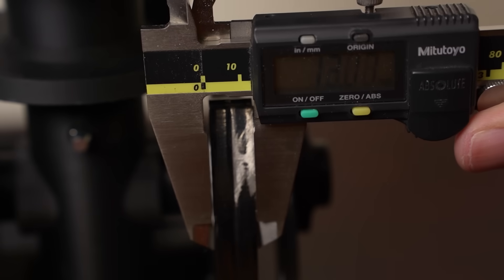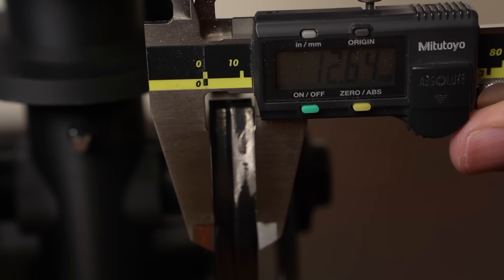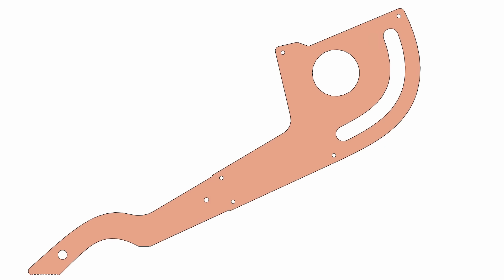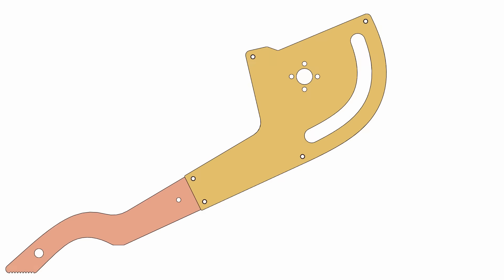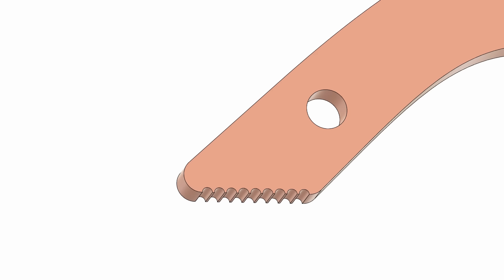When I first started planning this project, I knew I would have the legs made out of laser-cut steel plate, so that determined the scale of the sentry. I simplified the hind legs into two main plates: an inner, longer plate that makes for the real rear foot, and an outer plate to thicken the haunch to better match the game model. While welding them together would make the most sense, I don't have any welding equipment, so they're screwed together in several places. The inner leg doesn't do much, but since it is the actual rear foot, I added some tiny serrations to give it better grip.